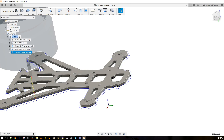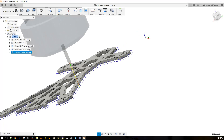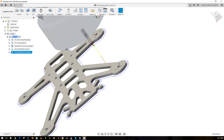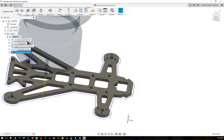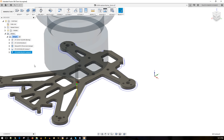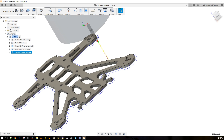I decided to go 1.25 millimeters per pass with the 2.5 millimeter end mill. I'm using some pretty cheap end mills I found on Banggood — a kit from about 0.75 millimeter to 3 millimeter; I'll link it below. They're described as titanium. We're going to have to cut two of these frames, so we'll see how they perform. I think the profile looks good, but we'll figure it out.